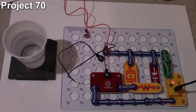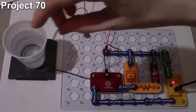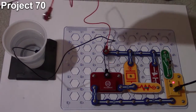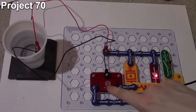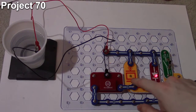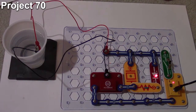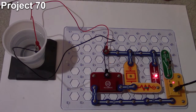The two leads are placed where we want to detect the presence of water. When the switch is on and we place the black lead then the red lead into a cup of water, the alarm IC activates, we hear audio from the whistle chip, and the red LED lights up. The volume through the whistle chip is enhanced by the 100 ohm resistor.